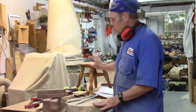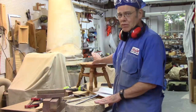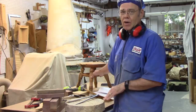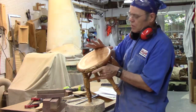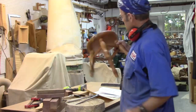Most any kind of wood works for this project. This one was actually made out of some red oak from a downed tree. It was cut green — I cut it into blocks, sized it approximately, and put it in my garage to dry for a year. For the top I cut it into two pieces because I was afraid it was going to split, knowing that I could join them together, which I did.